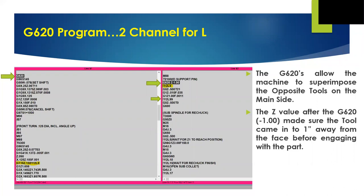By using the G620, the pin was instantly superimposed to the face of my tube, and I just programmed the movements to my part. The highlighted lines ending with L9 are the wait codes that controlled when the pin started to move. After the pin rapids to one inch away from the face, the code calls the pin to eventually stop at one inch into the part. There's no Z1 or Z2 here — it's just Z. The pin stays at one inch while the gang tool turns the part. The subspindle would be moving backwards as the tool came out of the guide bushing, keeping that pin at its one-inch mark. There's a second wait code in the second channel, highlighted by a smaller arrow ending in L99. When the program in $1 hits the same code, the subspindle rapids to half inch away from the face, then all the way back.